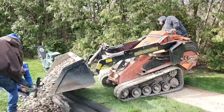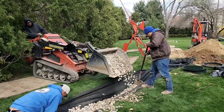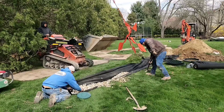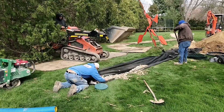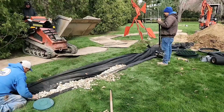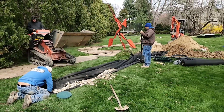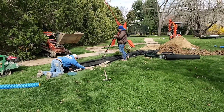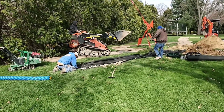Always remember to hold the pipe down when building a leech field, leech line, or French drain. Otherwise the stone will push the pipe over and get under it. The rocks will want to push the pipe against the wall of the trench and go down. Gravity is going to take those heavy rocks and carry them down — they'll get stuck underneath the pipe, changing the void at the bottom of the trench. The drain will still work but ideally you want the biggest void, and the biggest void should be at the bottom of the trench. That's where the water ends up.